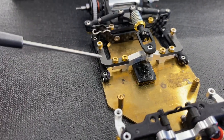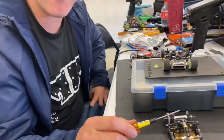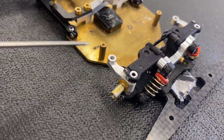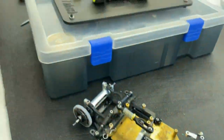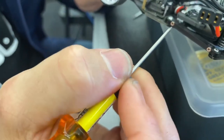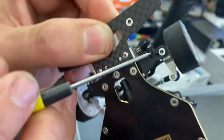With 3D printing we were worried about slop and getting everything set up, so I integrated these tightening screws for the sockets — like what they use on 1/12 scales. What that does is it eliminates the slop. Whenever you build it fresh it should be pretty tight, but over time as it wears you just tighten them. That was one concern I had about the RTRC — it's super tight and smooth but over time you're going to start wearing parts down and there's no way to adjust. Here's another revision: we slotted this side here, slotted here, slotted there, and moved the screws in the back, so now we don't have any of those clearance issues with tires catching.